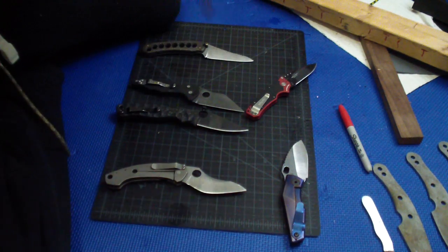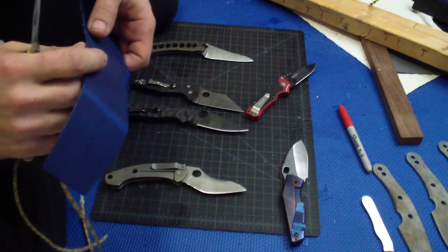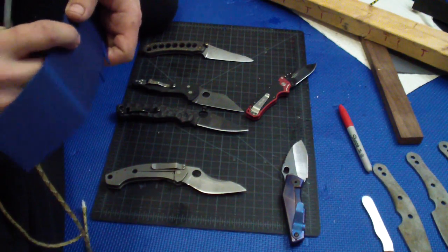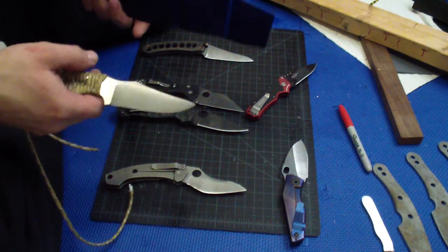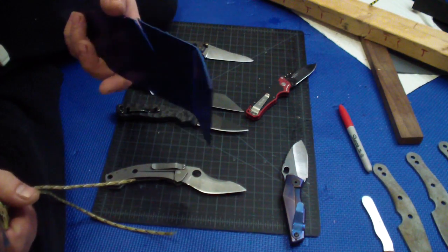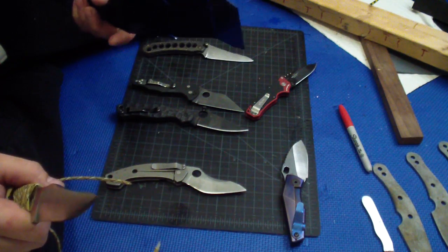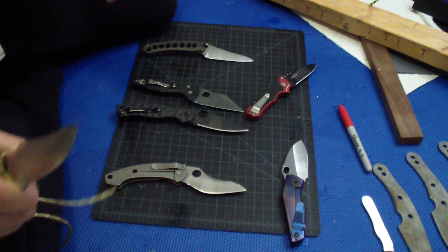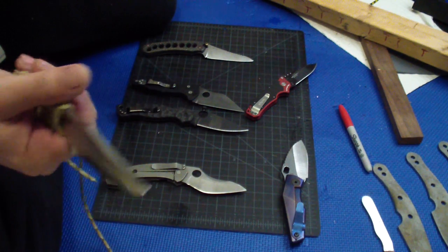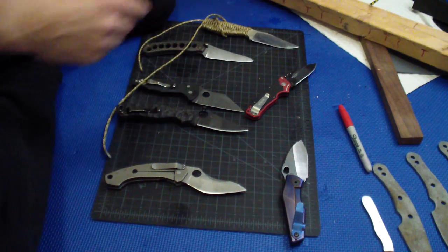You see it? What the convex does is it pushes the material aside. In the case of the Kydex, it will push it apart a little bit and then slide through. Hollow, it just will bind into it. It will just get stuck in there and it won't let you do anything. You will have to create an insane amount of force to break it or really push through it. You can, but with the same force, I can cut through that Kydex with this. So that's just a nice example.